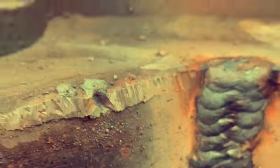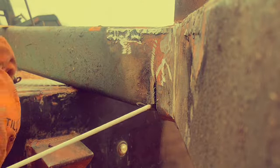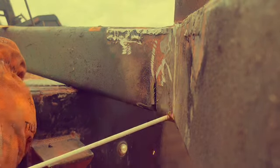See, it's pretty flat, not a lot of build up on the reinforcement, so shouldn't be bad to work with. So you notice where I did that restart, I came outside of my line of weld a little bit on the left. That kind of aggravates me, but it happens. Maybe I'm a little rusty, but we're not weaving anymore.